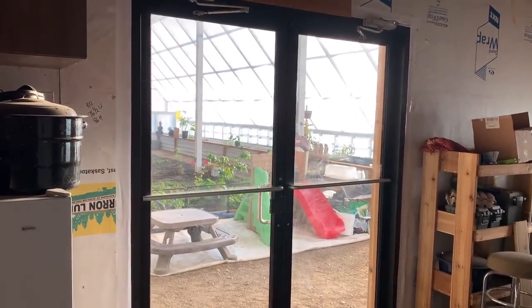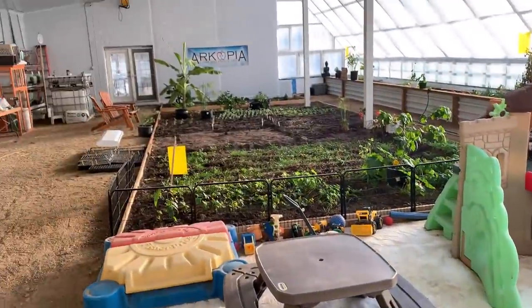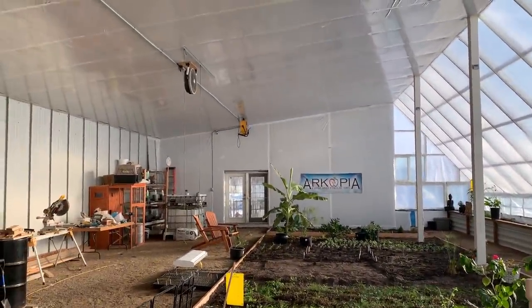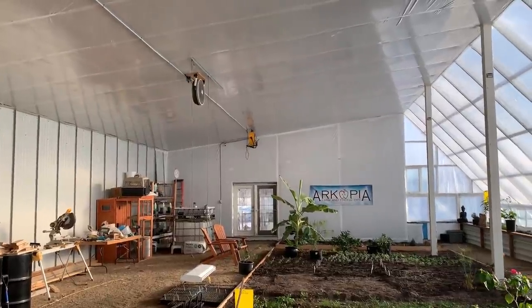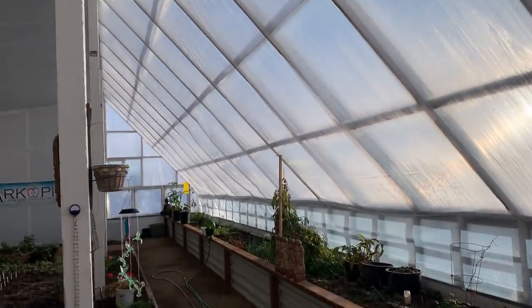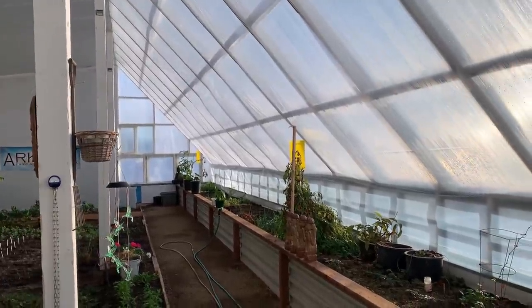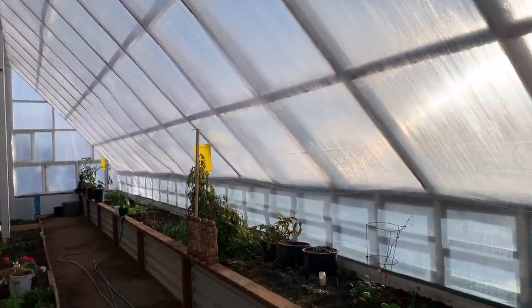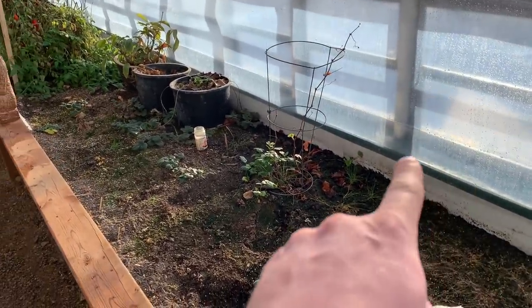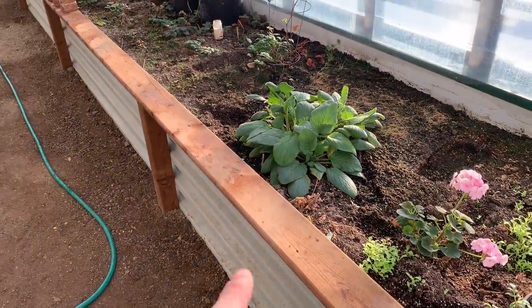Let's go inside the greenhouse — it is attached to my large farm shop. The main structure is 64 feet by 32 feet, the super insulated building, and then in the front it goes out 11 feet at a 45 degree angle. Two by six construction, four foot on center — you want the least amount of material possible because you don't want any shade from the sun, but strong enough for a wind load. This front bed is four feet, and it's also designed so I can put slats on the two sills to have all my tray starters.